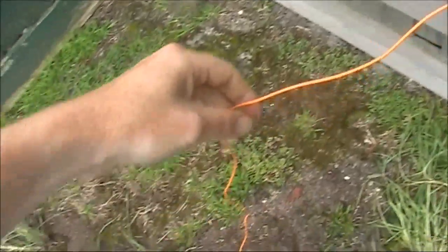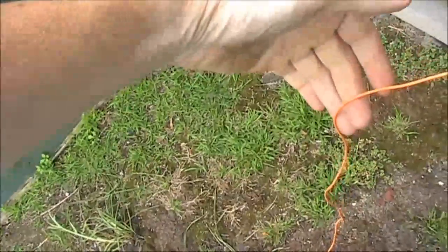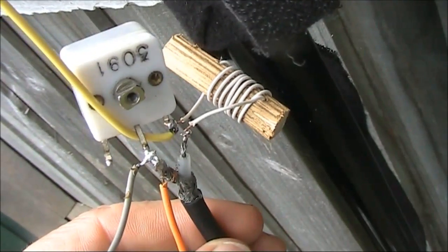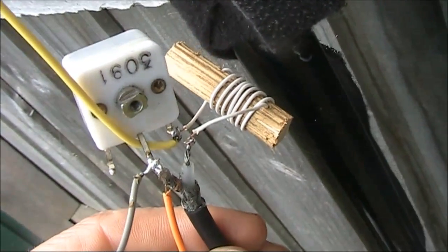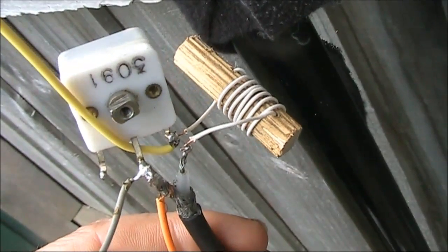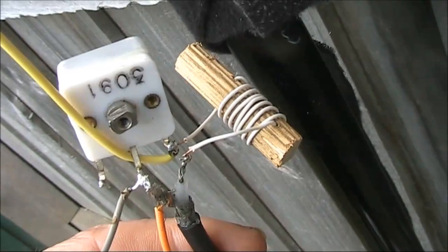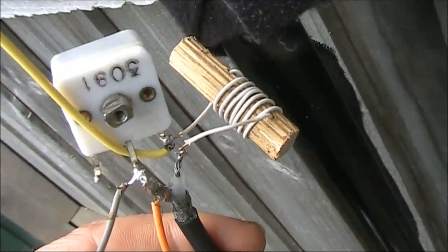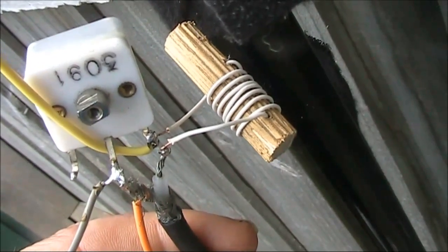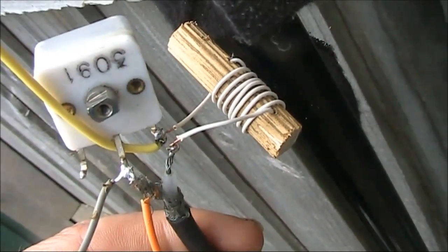I'm using a single radial. Again I didn't measure it precisely, but it's about a quarter wavelength long. The impedance here is high, therefore I've made a simple L-match. I'm using a variable capacitor — it's the normal two-gang transistor radio type, but I'm using the small half of it, which has a maximum of about 60 picofarads.